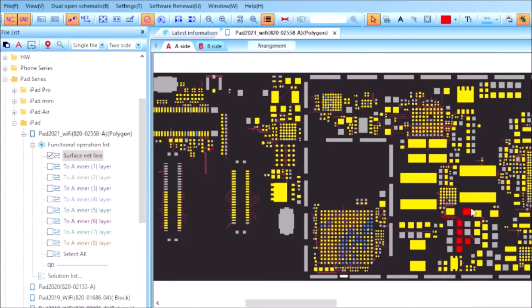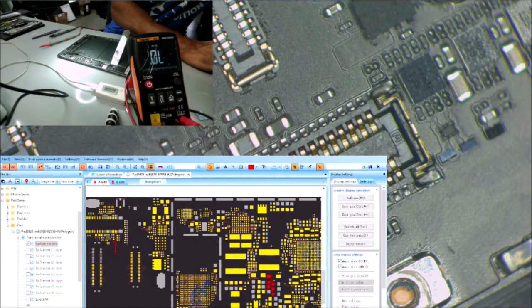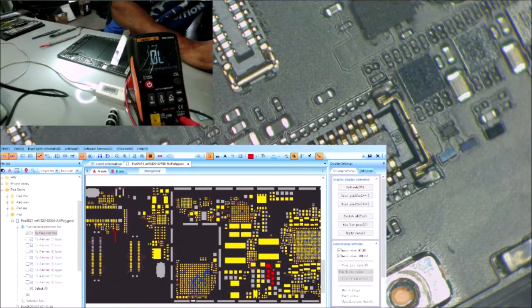I'm going to test them. I test this diode. And we want to test these two coils, if they are open. There are two sides of the backlight, so one coil is half of the backlight and the other coil is the other half. Let's try to get the two windows at the same time, like this.